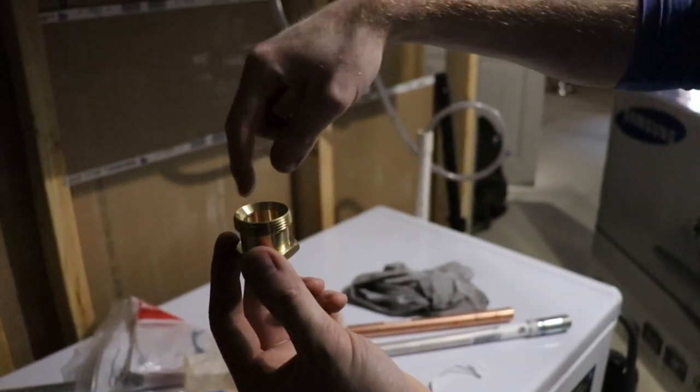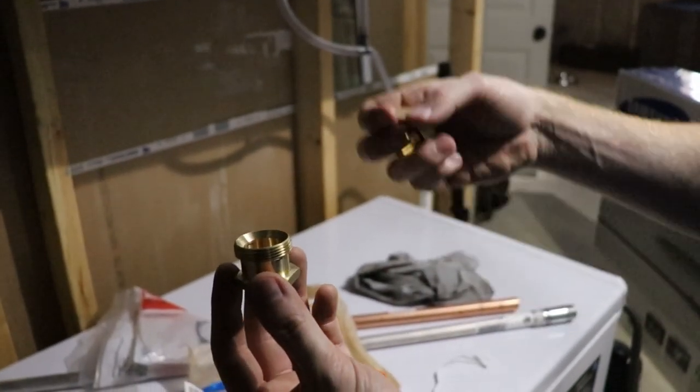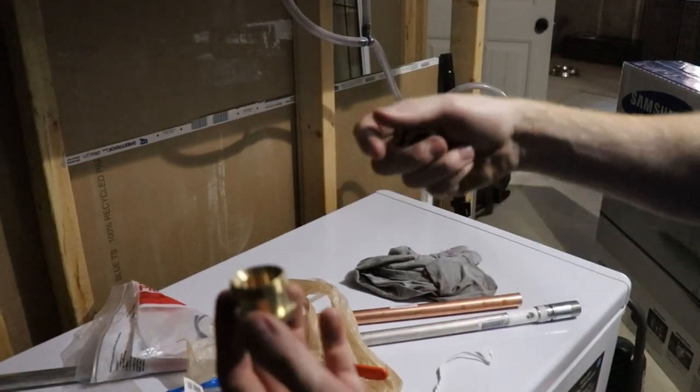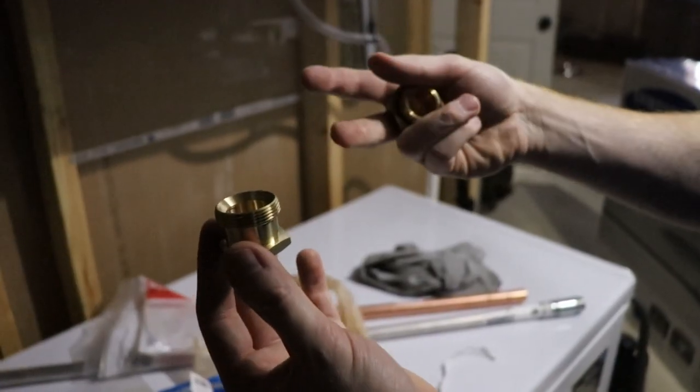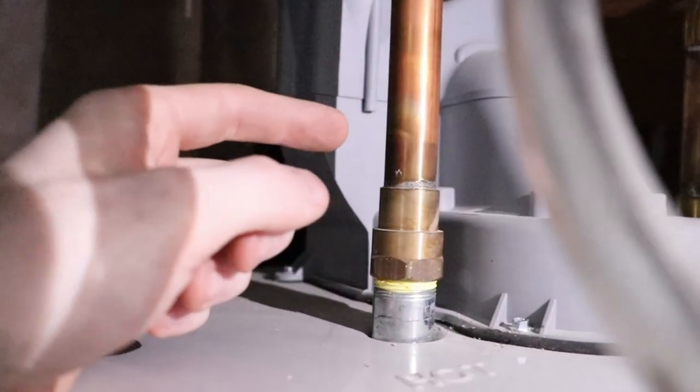Sometimes there's a separate line, and you just unbolt it, bring it up. This one happens to be on our hot water supply line, so this allows us to disconnect and service that item, and maybe remove the hot water tank easily. Now, if you look at the cold water side, or even this hot water side right now, they didn't put a union, even though it kind of looks like one. It is soldered on, so I can't unscrew that, because it wants to turn the whole pipe.